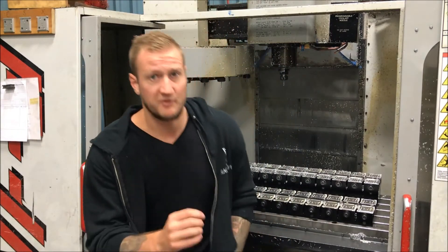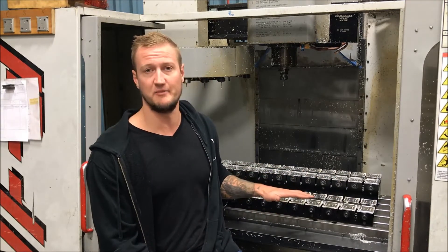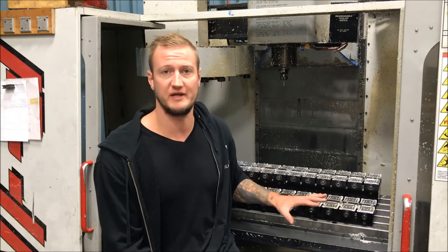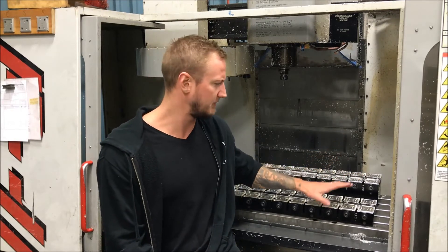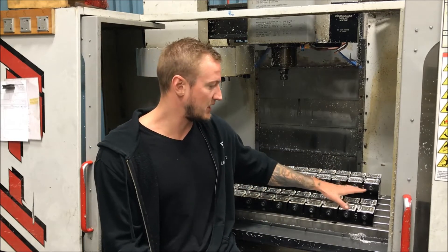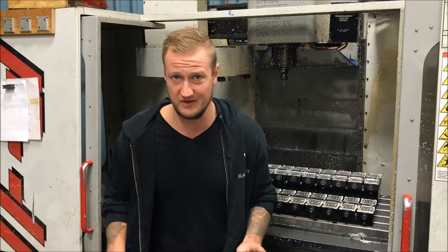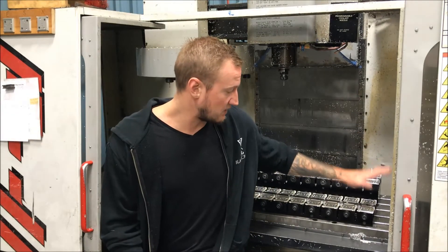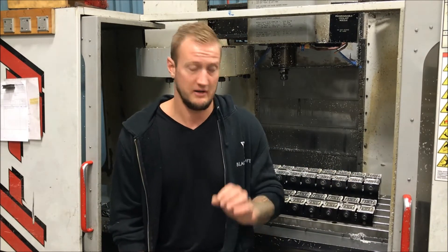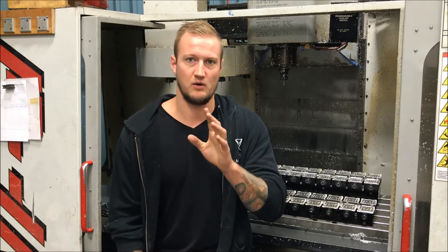So when I say actual fixturing, I'm referring to things like this behind me inside the Haas VF3. This is a fixture we made up — it's actually hard anodized aluminum, just because we wanted to be able to make a clamp. You can use steel for these. But a large aluminum fixture like this that lets us do 60-plus parts at a time is great for production jobs. We run tens of thousands of these parts a year. These parts come out completely finished — they have the rads down on top, rads down on the bottom, completely deburred. They go from here straight to anodizing. We used to run these parts five at a time back in the early 2000s and I'd have to deburr them by hand and belt sand them.